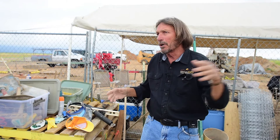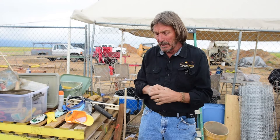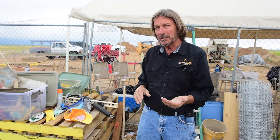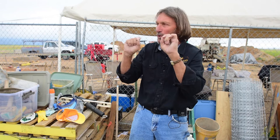Again, just like when we laid the blocks in the wall, you can't have too much water, really. You soak the blocks. You never lay the mortar on a dry surface. And again, this has to do with the cure. You want the cure to be as slow as possible. And so if the surface that you're putting the mortar on is wet, you will slow the cure of the mortar. The University of Oklahoma, Charles Graham, did quite a thorough study on how wet it was and what the end mortar strengths were, and a big advocate of wet material.